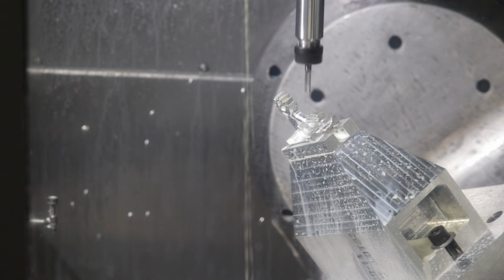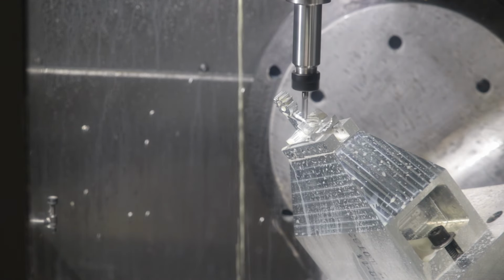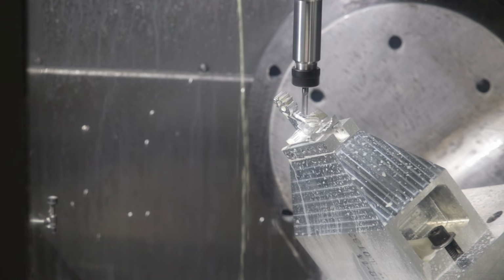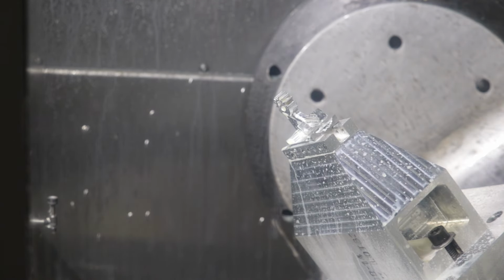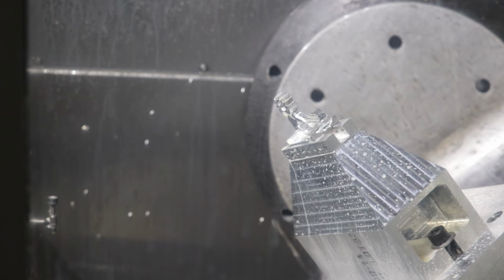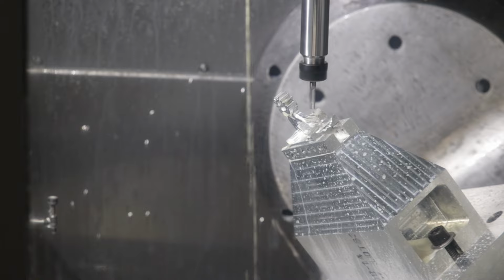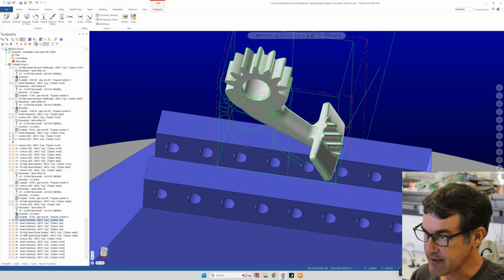Actually, I think technically this is the swarf because it goes to this weird angle and then comes in, where the previous cuts were just parallel facets because these teeth are like 90 degrees to each other. So this is actually the tricky 5-axis operation. Yeah, well, the other one was also interesting, but it's a simpler cut than this swarf cut. You'll see it roll at the end here, which I guess we can just look at right now.